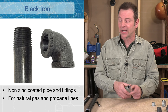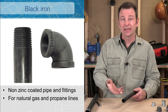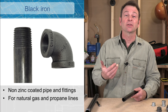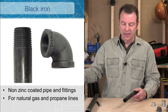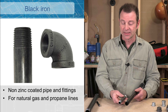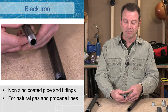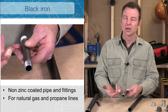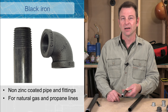Our other type of pipe, black iron, is used for propane and gas lines. It has a black appearance and the same threaded connections on the ends. This pipe is not zinc plated or zinc coated — that would cause corrosion when you mix in propane or natural gas, which can cause failures at the fittings and corrosion on the inside of the pipe. This is raw steel pipe; this one's been painted which is a little surprising. More commonly it is literally just raw steel, so it is greasy — it has some oils on it to keep it from corroding — but other than that, black iron pipe is sort of a simpler version of our galvanized pipe.